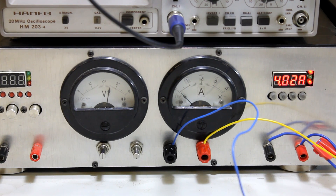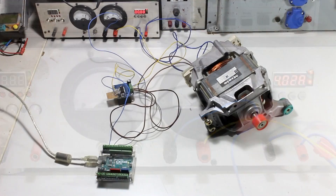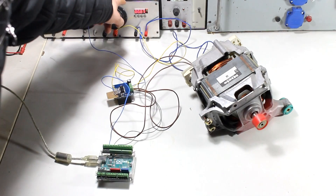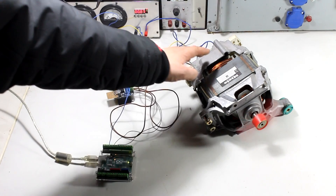You might remember my self-made lab power supply — it was part of a greater plan. It has three independent outputs, designed so I could control motors like this in experiments. So I connect the two blue wires, the field coil, to a buck converter working in current limit mode, and then I control the motor via the two brown wires via the large linear regulator that goes up to around 30 or 40 volts. But in order to reverse the rotational direction, I also need an H-bridge.